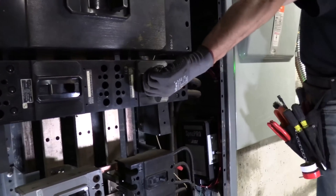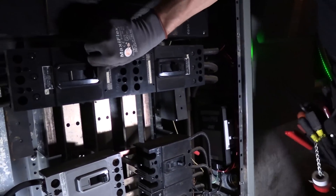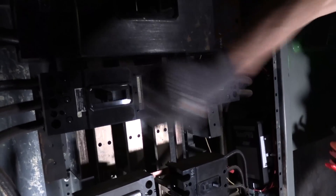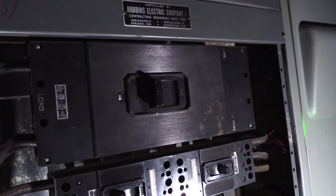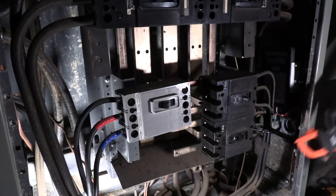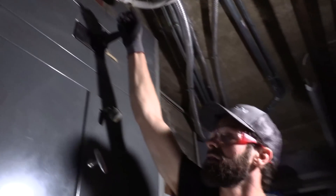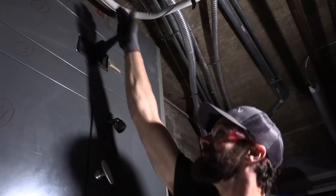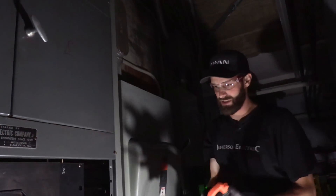Look away, because you never know if there's going to be an arc. There are lights — it could be a bright flash. Here's another one. Did we get them all? Newer ones are real crisp. It's at 16. Three, two, one — that was fine. Now let's check and just make sure it actually did de-energize things. Back to volts AC — we're going to go phase to phase and phase to ground. That's a functional zero.